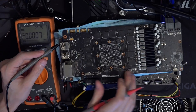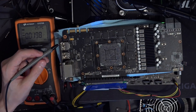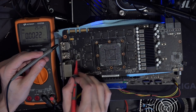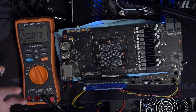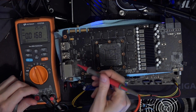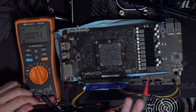What I really like about this DirectCU 2 card is it actually comes with a dedicated VRM heatsink that's not attached to the GPU heatsink, because that means when I cut off the VRM, I don't need to figure out a cooling solution for it. Now I suspect that this regulator right here handles 5 volts — yep, 12 volts in and we get 5 volts out. This is important because I'm 99% sure that this 5-volt regulator is necessary for this chip to run. So what I can do, before I cut the PCB, is start working on moving this regulator over to the side I'm going to keep.